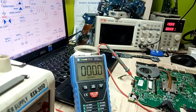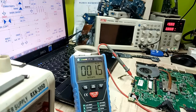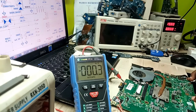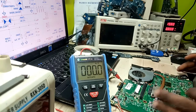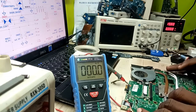AC OK has active-low logic, meaning when AC OK is low, it confirms the adapter is present. But at times when working on a board, you have to make sure you correct everything that needs to be correct. The clue here: I have 3.3V — I don't have 5V. I have 3.3V but I don't have 5V, which is not supposed to be. Based on this architecture, both 3.3V and 5V should be present.